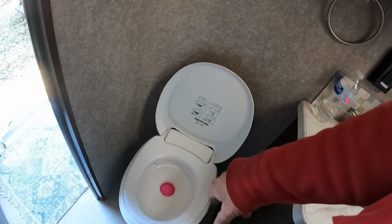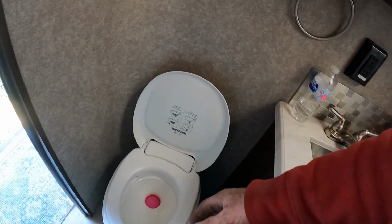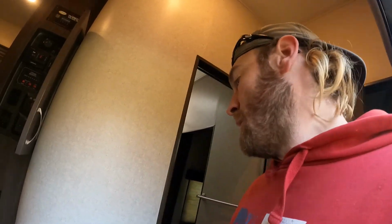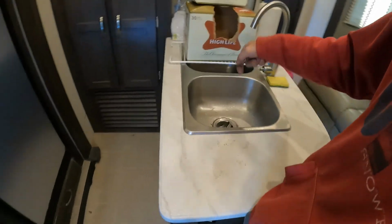If you put a gallon or half a gallon of antifreeze in your black tank, it'll keep it from freezing, so your number 1s and 2s won't freeze solid. They'll stay a little bit slushy. So that's kind of a trick, and then you can still drain it and use it. You just don't have running water, so you don't have a sink. What we do is we bring a big 5-gallon pail of water, set it here, and we have it for running into the sink, washing dishes, cooking, the baby bottles, whatever. Coffee, especially coffee.